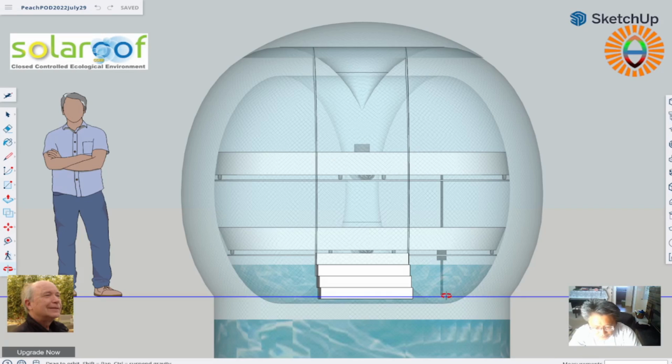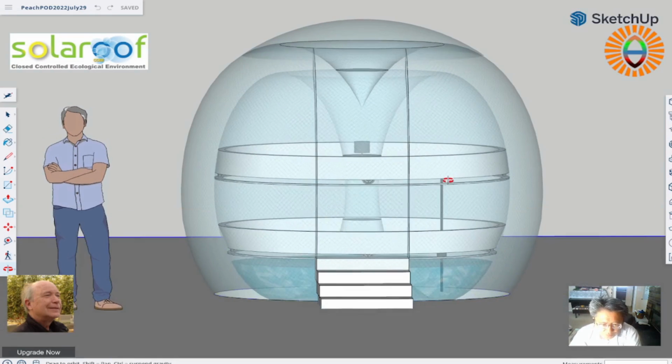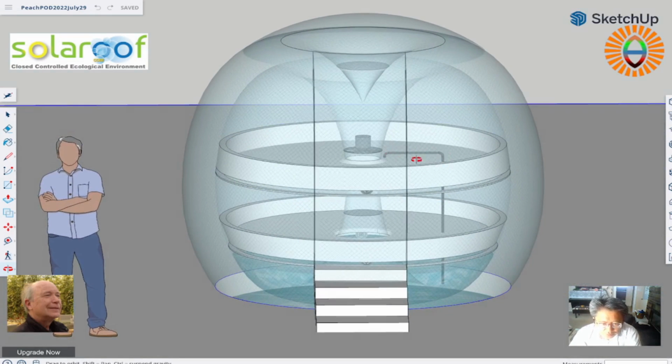Anyway, so this pipe basically is a suction pipe, right? So the pump pumps water, and this pipe sucks the fish poop at the bottom because of this special sloping, and the fish poop will stay here at the lowest point of the fish tank, right? So the suction pipe will be just simply doing the suction operation and then suck the fish poop together with fish water to the top, and then through a horizontal pipe, move the water to the center, and this thing is spinning.